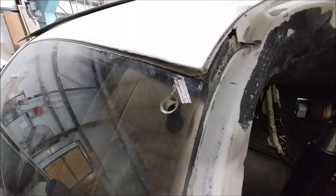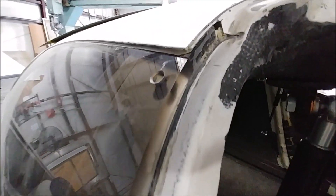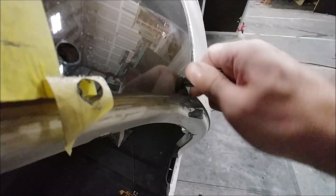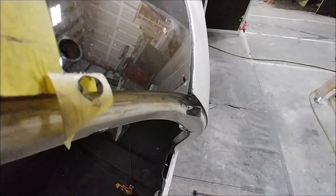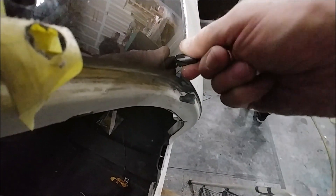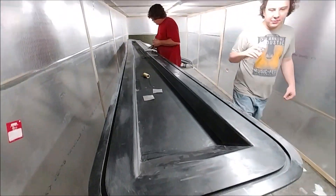Welcome back. If you recall on Friday I drilled the first of the holes here for the fasteners on the windows, so my mission on Monday was to drill the other 35 — and that was no easy task. After drilling each one, which I had to do very carefully by hand in order to not crack the acrylic, I had to put a little chamfer on the edge of each hole using a countersink bit. I tried doing it with a drill bit but it always left a little jumpiness, so doing it by hand was the only way, and by the end of the day my hands were shot.